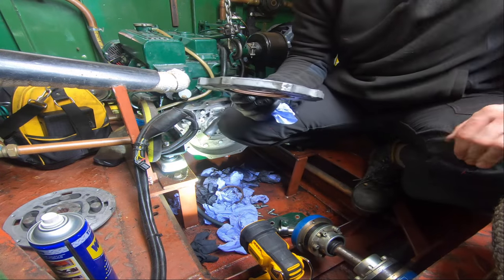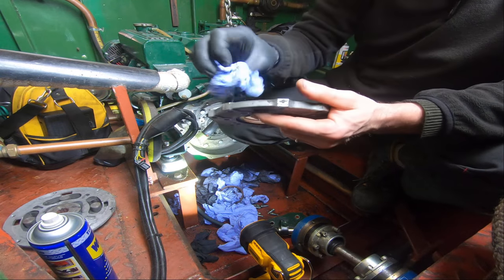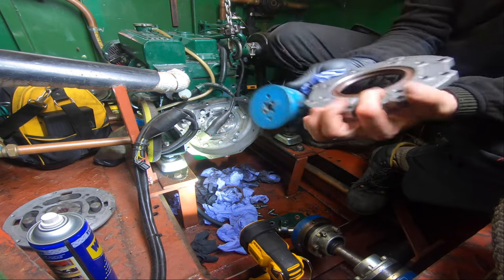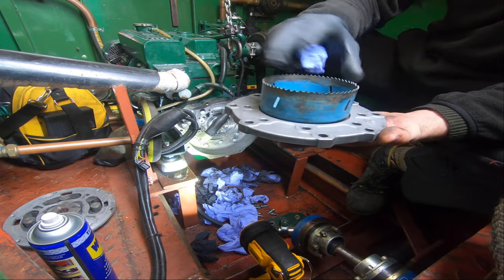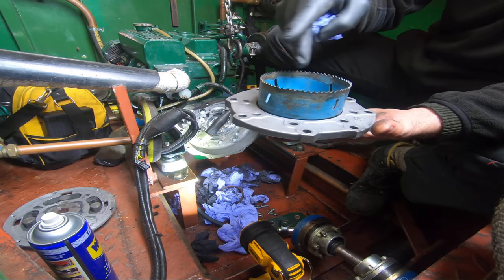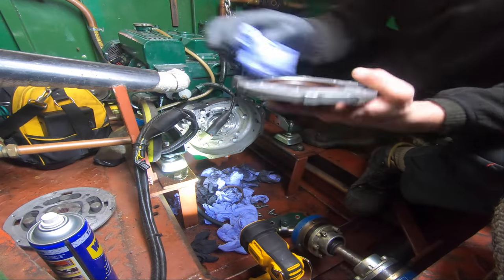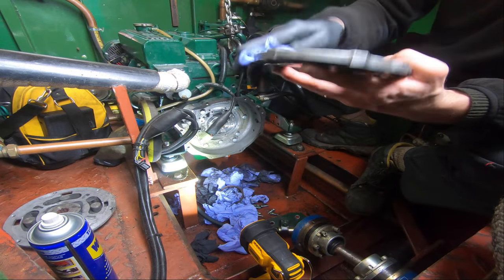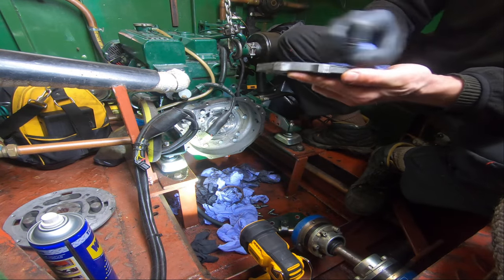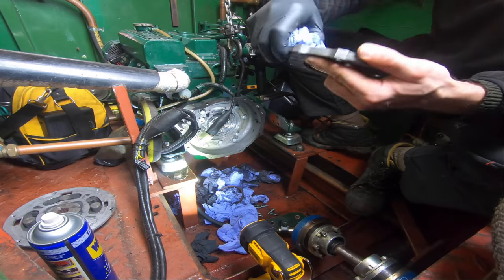So I've got to clean off the car. I used a flywheel as a little plate to put this down on. I should have filmed that actually, and just wasn't sure it was gonna work or not. Let me show you what I've done. So I'm just using this as a diameter, putting it in that way. It sits straight on top, and it's a nice fit. It's ever so slightly smaller than the diameter of this housing. And hit it center, just gently, take your time, check, take your time, check. Yeah, in, all good. I've got a little hydraulic puller in the van, which I could have set up as a kind of portable hydraulic press, which I've used for lots of little jobs. It works really well actually, but I'll give it a try with what I've got, and it's actually worked, so that saved me setting that up.